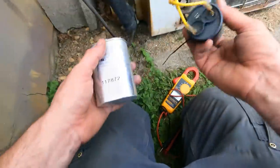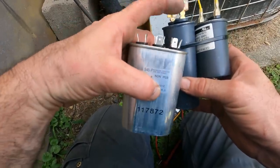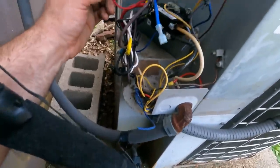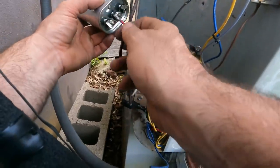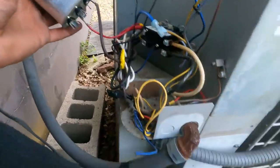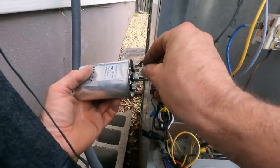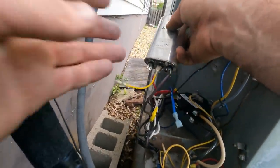What I'm going to have to do is connect from here to here, and then the wire going to the herm to the other side. Let's first connect — yellow, I mean red — we're going to come up with the red wire to the center. That's going to power my fan. Okay, that's good. Now what I'm going to do is I need a yellow wire — got one — I'm going to connect to here. It's like a pigtail, I'm going to leave it hanging.